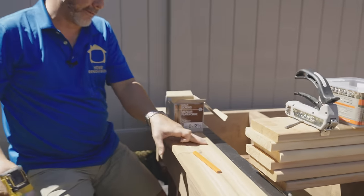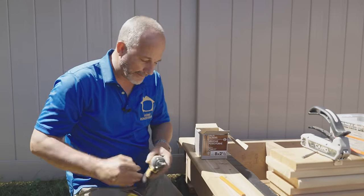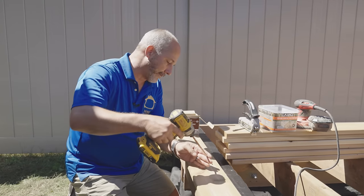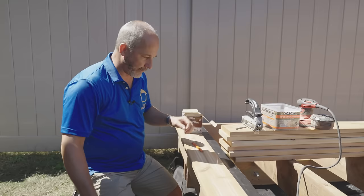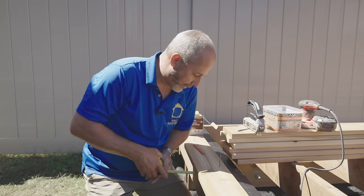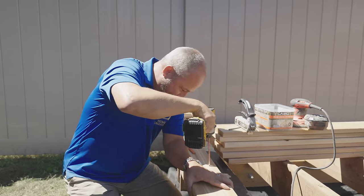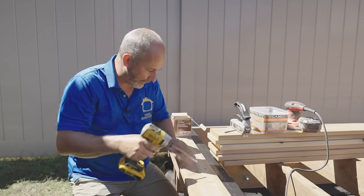And you don't want to get a sliver, okay? If you go too deep, the wood fibers will break off and stick up in the air. And then people will be using your deck in their bare feet, because people still do that. And they will get slivers and they will get infected. And when they wake up the next morning, drunk on your floor, they're gonna be like, oh, my foot hurts. What did you do to me? And it'll be all your fault because you didn't take the time to set the screws the right depth. Okay, see that? Those fibers are dangerous.